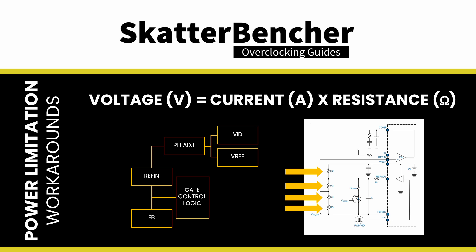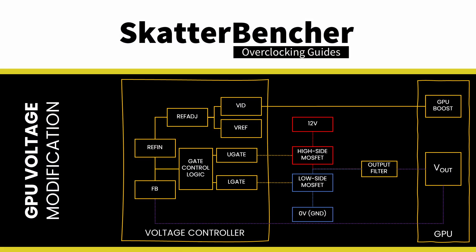Instead of replacing the resistors, we can add a variable resistor in parallel with any of the four mentioned resistors, which will effectively decrease the resistance of that resistor. That is the typical approach for hardware modifications, as we can use a variable resistor to change the voltage on the fly. Alternatively, we can inject a current at the REF-IN point, which increases the voltage to REF-IN. With the Elmore Labs EVC2SX, we go for that third option — altering the current in the circuit to change the reference input voltage. In addition, we also remove the resistor connecting REF-Adjust and the GPU V-ID from interfering in the circuit.